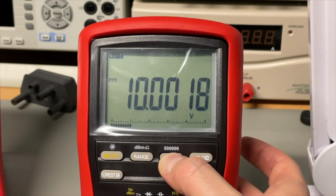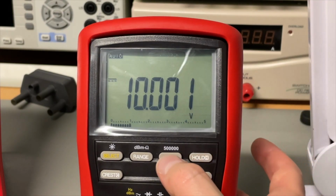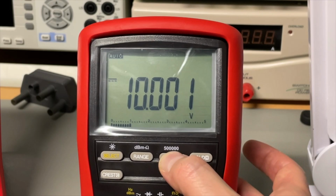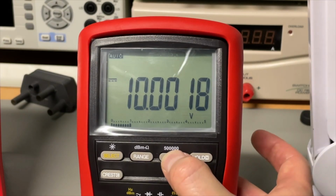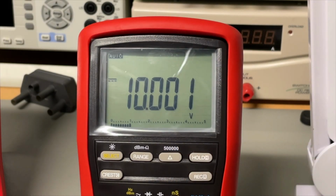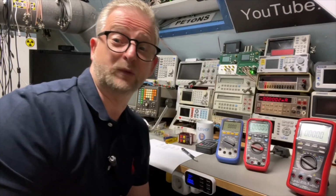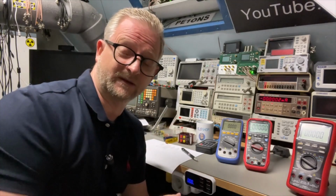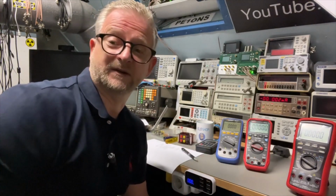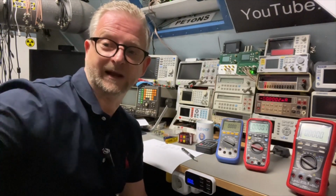Rounding is a bit weird, by the way, because it says here 1, and it's actually 1617. And it should have been a 2. Actually, that's weird, but I like the extra digits. I will do the same with the currents, 4 milliampere, 10 and 20, and then I will write down in the table that we can look at later.